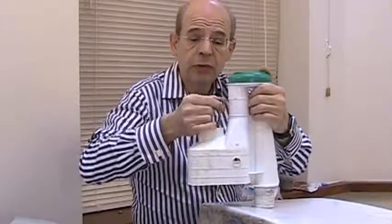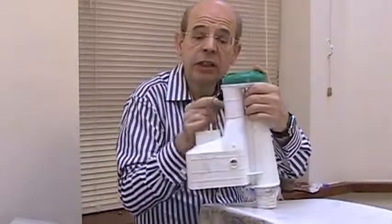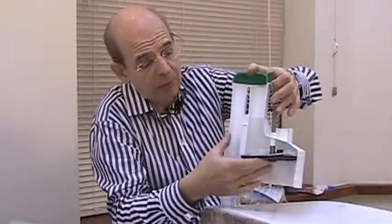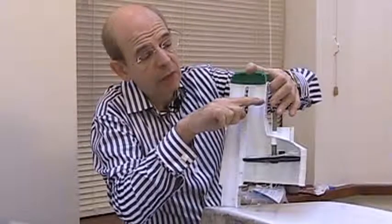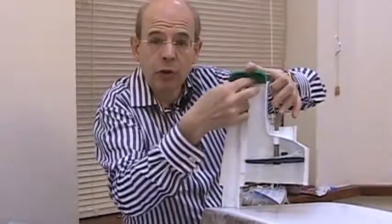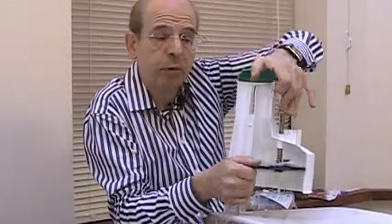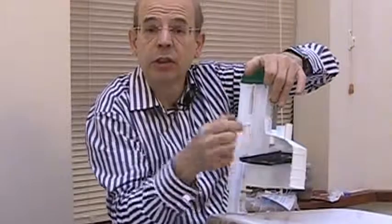Here's a typical siphon. The handle is connected directly to this metal ceiling and when you pull this up, the diaphragm — which is here, a layer of plastic — it pushes up. The water in the siphon, which will be up to this kind of level, is pushed up and over the siphon and flows out, and that triggers the siphon action that empties the cistern. What happens when you've got difficulty flushing with the lever is that the diaphragm gets broken, as it has done here, and when you pull this up the water just flows through in between the cracks and isn't pushed up over.